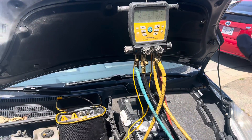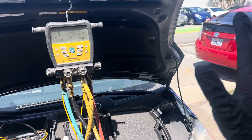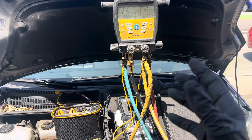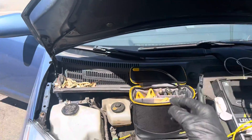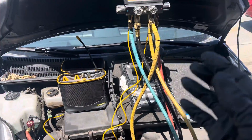It's 77 degrees right now, so it's doing good enough. And that's one thing you can do — experiment. When you guys are learning about air conditioning, experiment and forget the analog gauges. Get the digital, get the software, graph it and learn as you're doing.